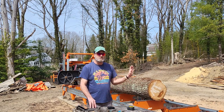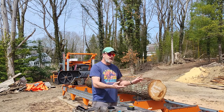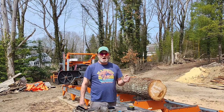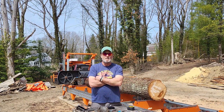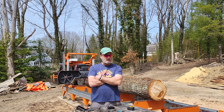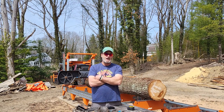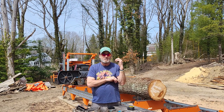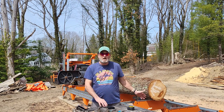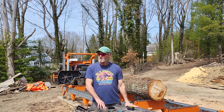No doubt in my mind that it's going to cut right through it, but we're going to test it so we can see it. So when I say, man, I like them rollers better, I got a goddamn data to back up what I'm saying. I'm not just going to say, damn ceramics suck. Rollers are way better. Now, if I find out that rollers are not way better, then goddamn it, I'm going to say so. So far, rollers are way better. If they're set up right. And if you don't know how to set them up, you're fucked. You're going to run your band all over the place and you're going to be screwed.